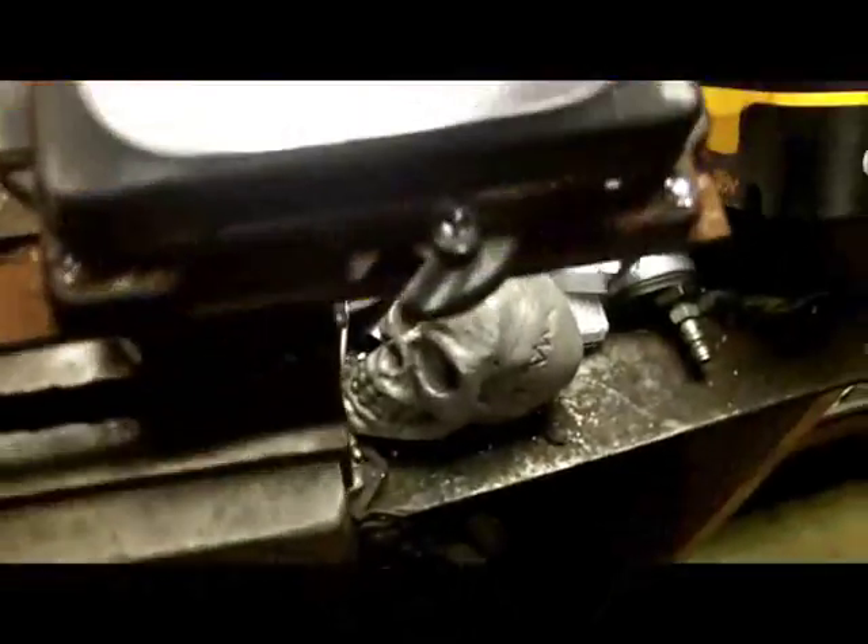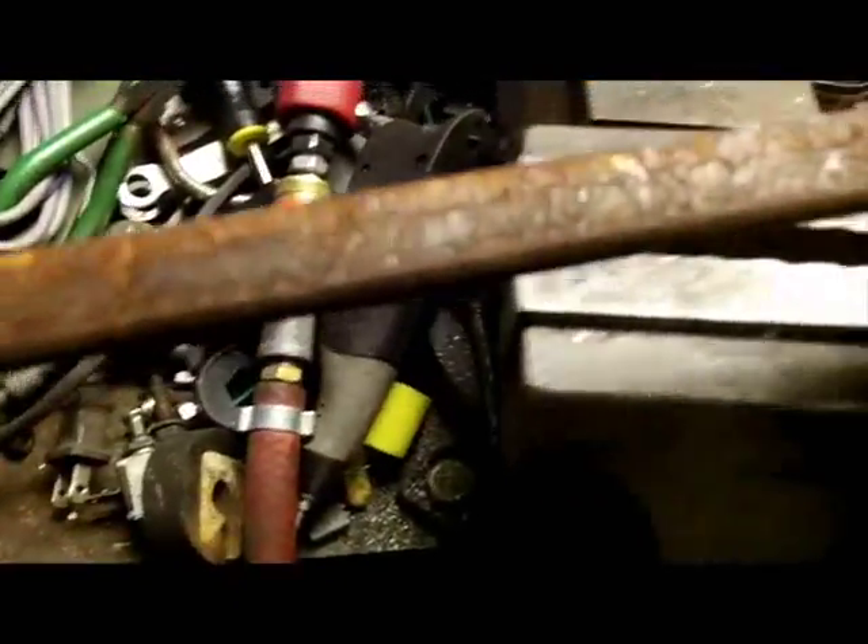I've got strips of 3/16 by 1.5 inch steel and I've been mounting it on the back of the bucket for the headlight, just some little screws for now. I'm going to cut the heads off those bolts. Thin steel on top of heavy steel — maybe I can just do the muffler welding and tack, tack, tack and make it stronger. I measured 7.5 inches so that should be my uprights, and these will weld on to the angle iron on the inside. The whole thing will be removable, I hope, and should be semi-straight.